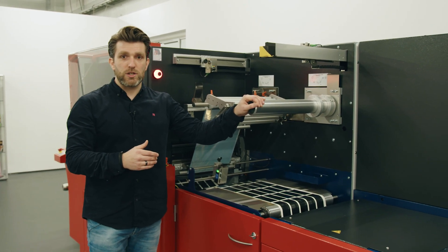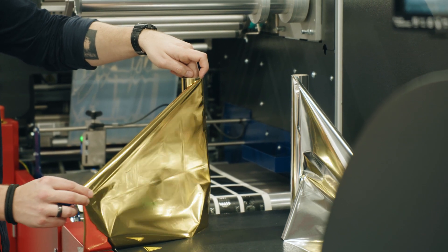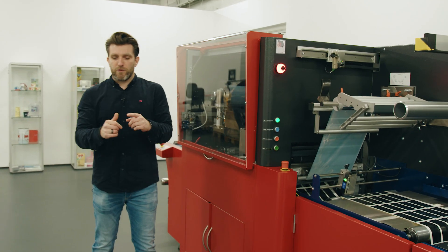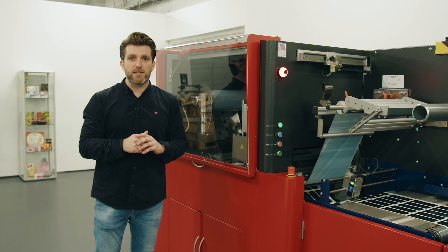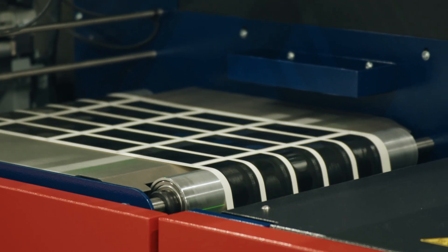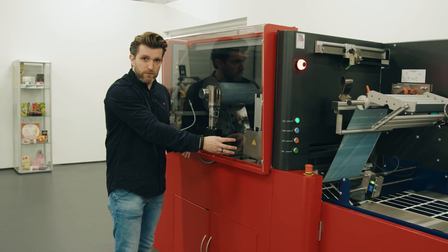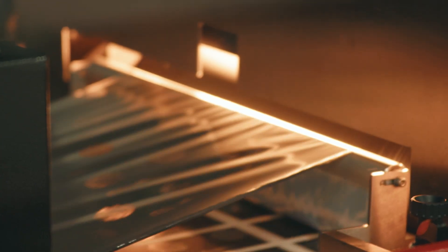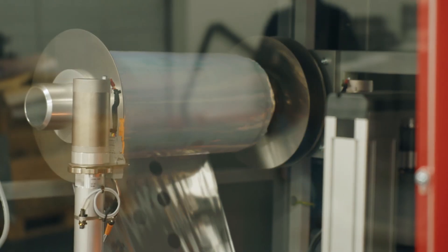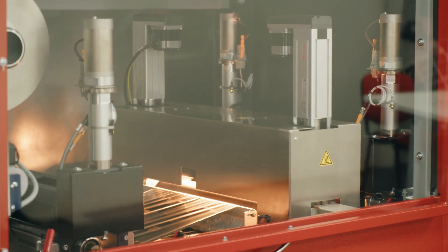After this, we have the foiling station. Two types of cores are possible — three inch and one inch — and we can load up to three foiling rolls onto the machine at once. For 2D, 3D, or variable thickness varnish effects and foiling, we use the same varnish. We print the foil image first in the varnish, cure at a lower percentage with the UV lamp, and come into this station. The station laminates the foil onto the printed web using a heated roller that heats the varnish and foil, and by delaminating, the printed image is foiled. You can create 2D foil, 3D foil, and you can even varnish onto 3D foil, creating even more raised images.